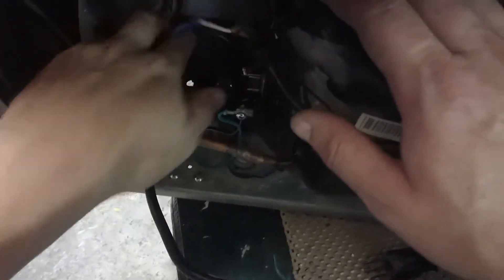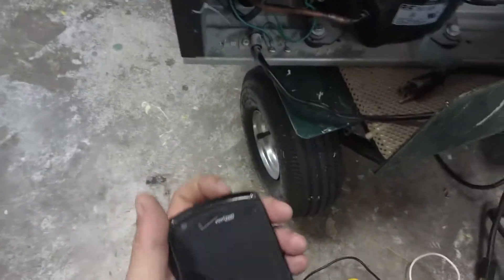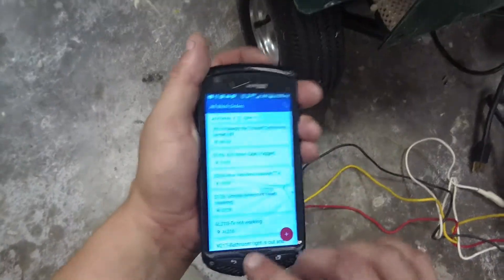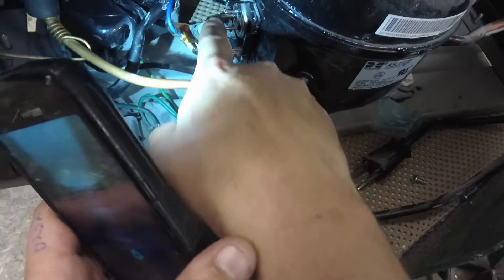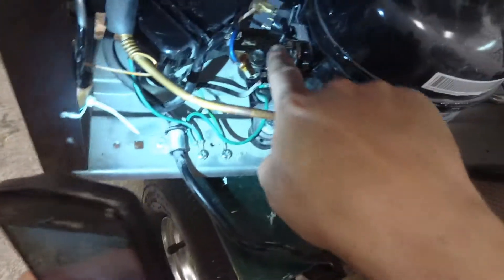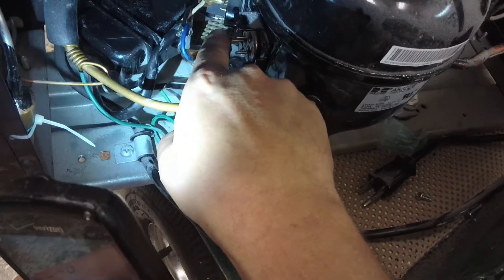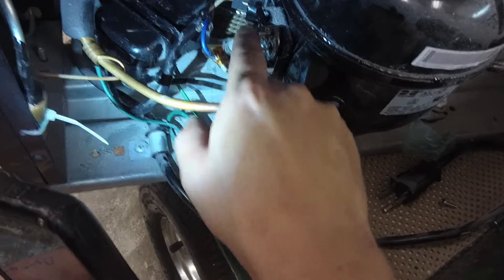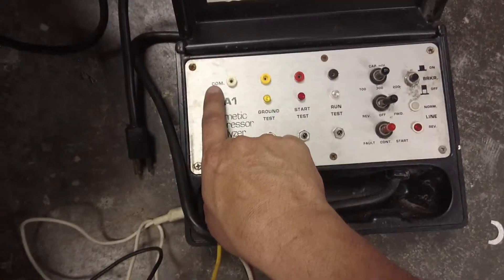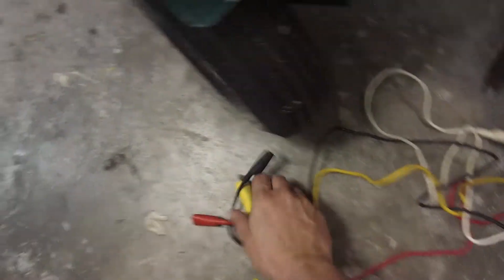What we want to do is remove all the wires and get them out of our way. Let me light things up a bit. So you have three prongs here — the top prong, this prong, and this prong. The easiest way, especially on a mini fridge — and this is a mini fridge by the way — is: C for common, S for start, and R for run.